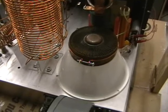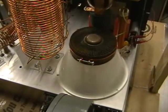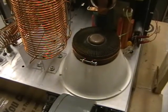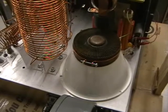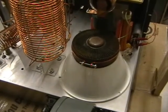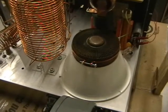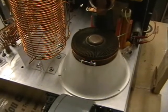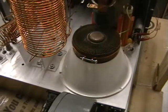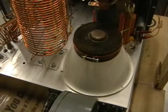commonly used in television transmitters. It is capable of producing 5,000 watts of power at a frequency of 215 MHz. In this service, the peak output power is approximately 1,500 watts, limited by driving power requirements and the capabilities of the power supply. The tube measures approximately 6 inches in diameter and 6 inches high. A large amount of forced air cooling is required to cool the tube, and it consumes approximately 250 watts of power just to heat the filament.